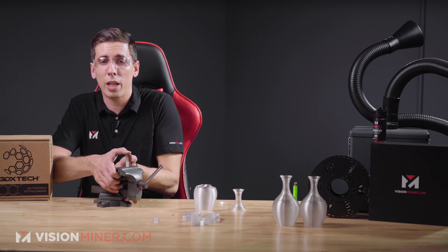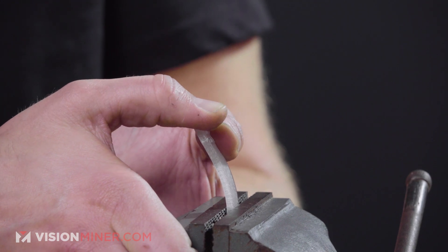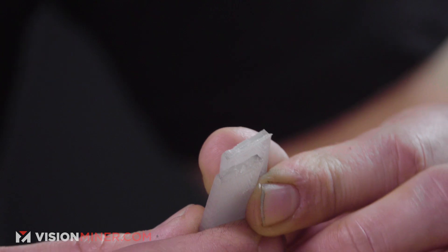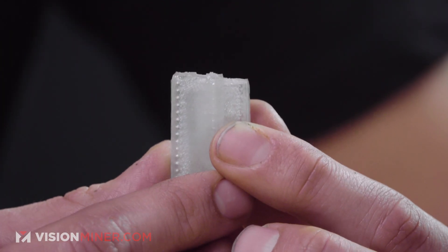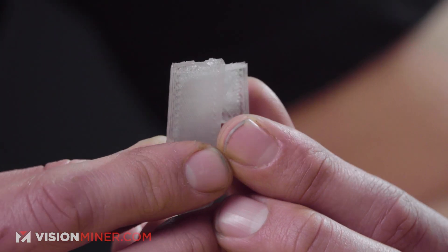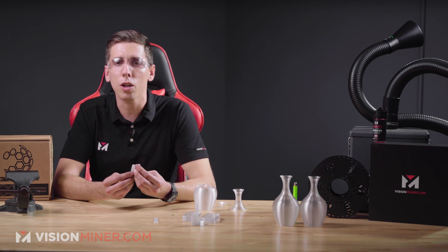Next I'm going to break one of these sample bars in this vice and watch how it breaks. I'll pull back and we're going to watch it explode or whatever happens. Okay, clean break — had a lot of deflection before it exploded. Look at how it broke: this looks like shattered glass, like an injection molded part basically. There are no layer lines jutting out. It didn't break across the layers; it just broke right there at the fulcrum — very, very cool, great adhesion. It's all about tuning and print settings and getting it dialed in for your geometry. You can use the profile that comes along with it, but if you're really doing 3D printing you're going to tune your part in — adjust temperatures, speeds, and even split processes to get it perfect. These ones turned out great.